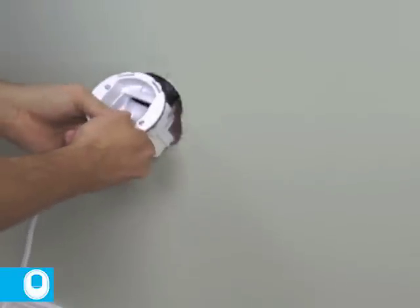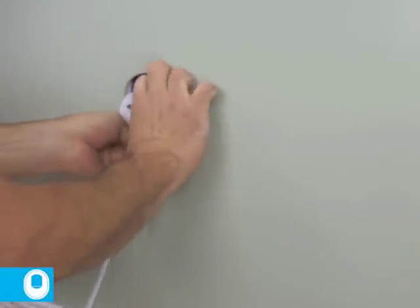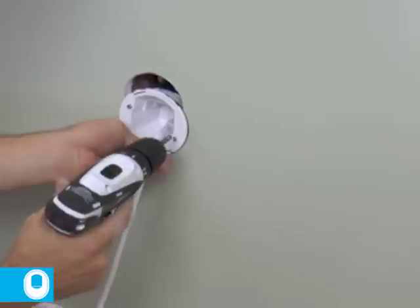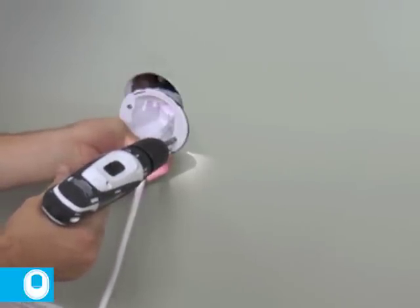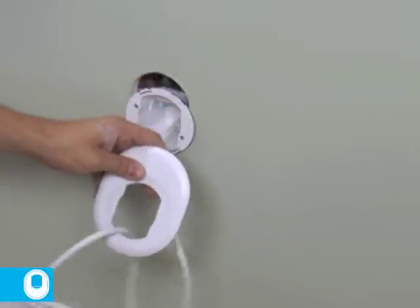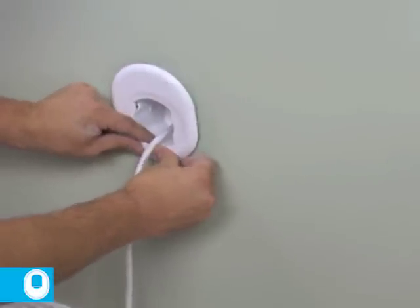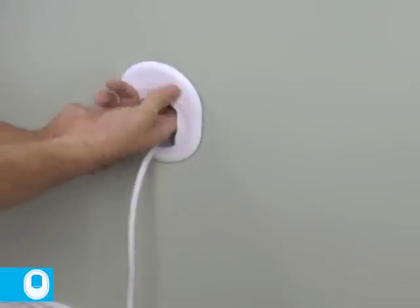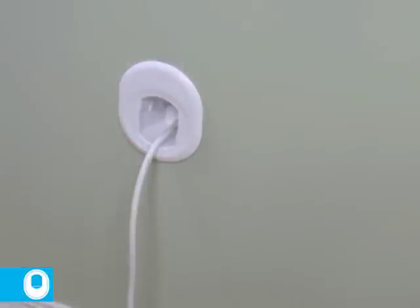Push the box into the bottom hole. Make sure to align the box vertically and bias it to the bottom of the hole. Tighten the screws. Snap the faceplate to the box — there are four snaps, so make sure that you hear all four snaps engage. There is a gasket on the back side of the faceplate; you may have to squeeze the box and faceplate together in order to compress the gasket and provide a good air seal.